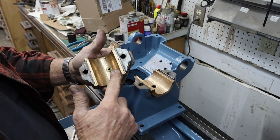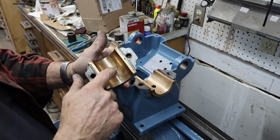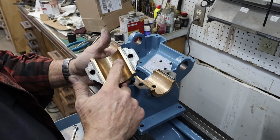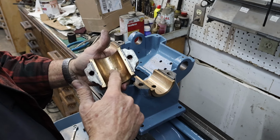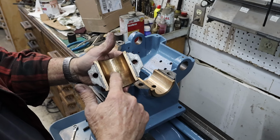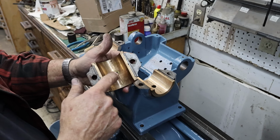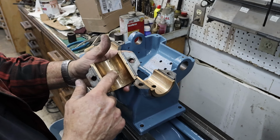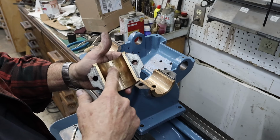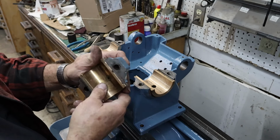Now the back of these bearings have got their groove down across the center, and these pieces right here, it's the same on both of them, there's where the grooves run down in the back, there's a cross hole drilled going this way to run with that. So when you oil them in there, not only does it put a little oil right down here, and this may get pushed up just a little bit more, I may relieve that so that it does weep all the way across. I'm sure I'll do that. I'll relieve those two bushings.